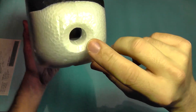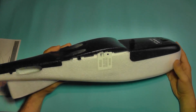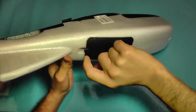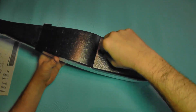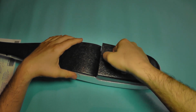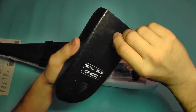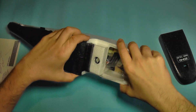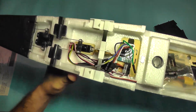It has a nice hole here for an FPV camera, another hole for taking in cold air and cooling the electronics, and another hole which acts as a place to put your finger in to take the cap off. This is also where the hot air from inside the fuselage will come out, creating an air current which cools the electronics. There's a second cooling vent here so you should be fine running a high power video transmitter. The canopy has a lever here which will lock and unlock it — easy to take apart. It comes out really nicely; it has a magnet and some plastic clamps which hold it in place.